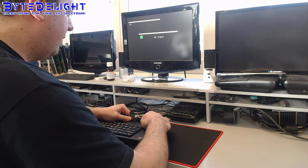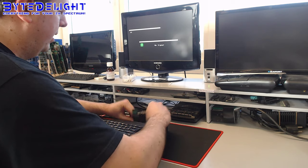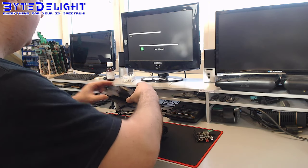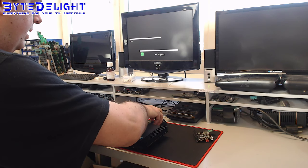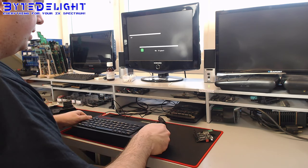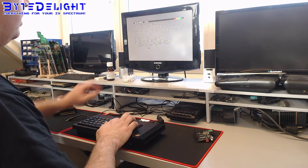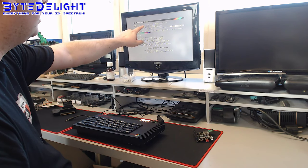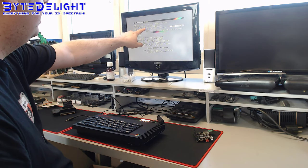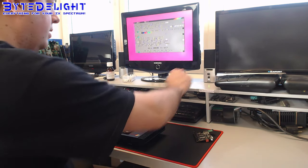Do some testing of the interface and so on. By the way, let's do a quick diagnostic test before doing anything else. Maybe it's good to show you that this Z80 chip is actually the NMOS type. You can see it's NMOS. It says here on the latest version of the diagnostic software from Brandon Alford. So it's an NMOS chip, and that's what I wanted to know. And now let's do a full diagnostic check.